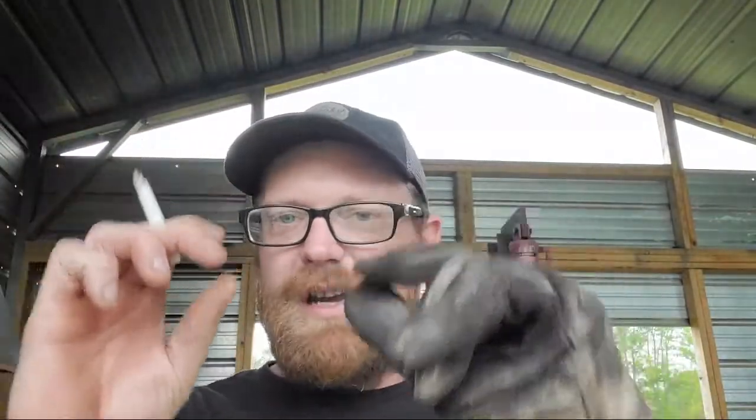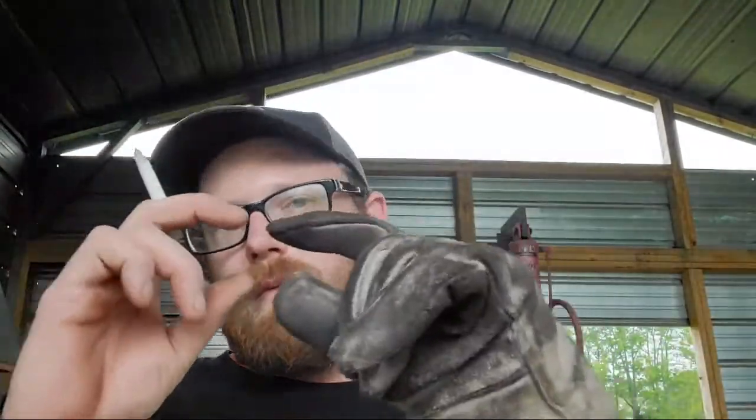The gladius has a ricasso, but once I do the grinding, you won't see the ricasso; the blade won't stick out past it. But there is a space from the bottom of the blade, where the sharpness ends, to the guard, which is technically called a ricasso, and that's what I'm forging in right now before I do the set downs for the tang.